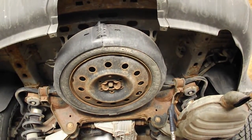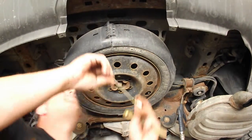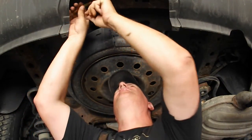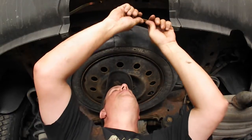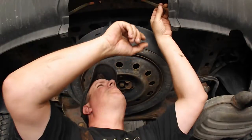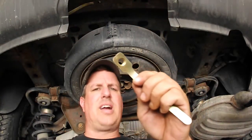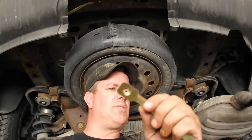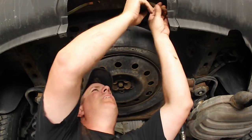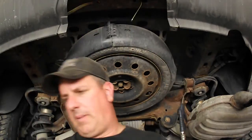I'm going to install these two nuts up inside the frame so that when we get to this point we'll be able to put a little bend in these things to get them up in there. One interesting thing to mention: the bolts that go inside these nuts are actually American thread — not the same thread as the metric ones — so don't get them mixed up. The dark or black ones are all metric and the silver ones are the American-threaded bolts.